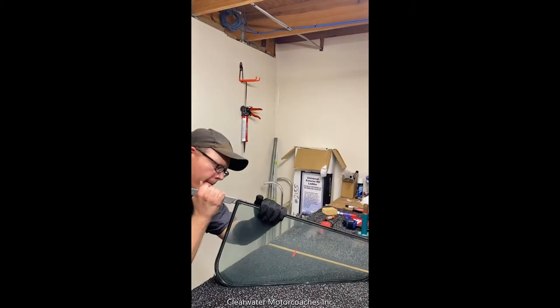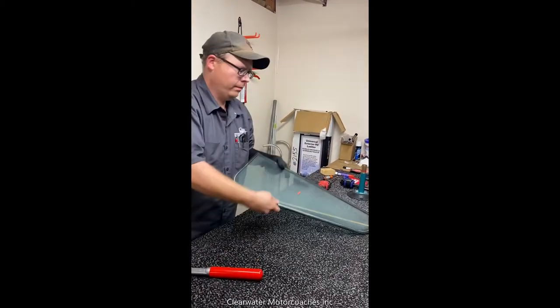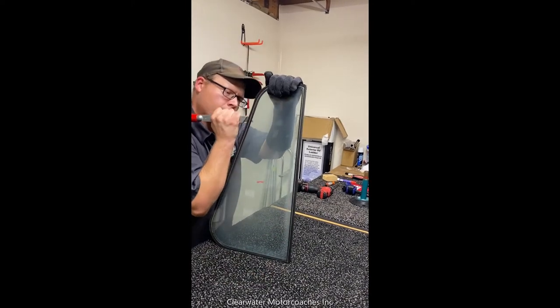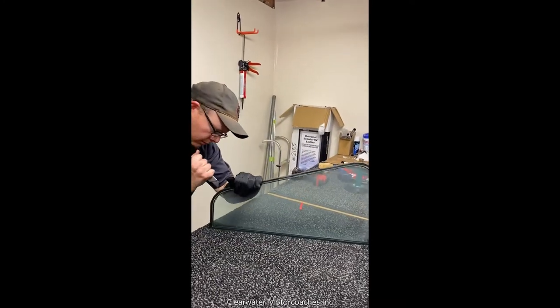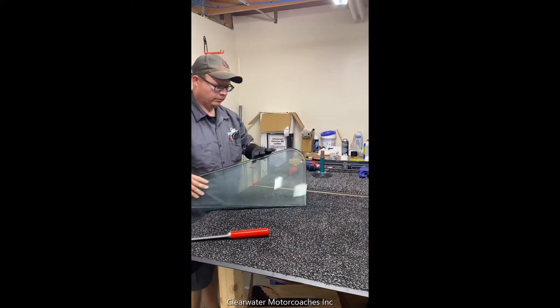After glass is removed from frame, then you can carefully cut the panes apart in order to remove old seal, clean up glass, and apply new two-part seal. We manually cut them apart to reduce risk of breaking any glass.